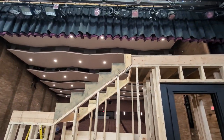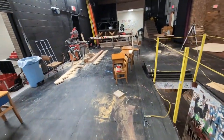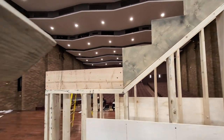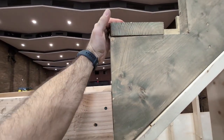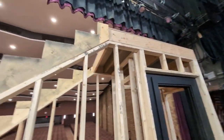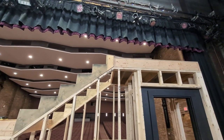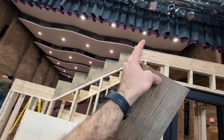Well, it's damn close, but it's not going to work. You've got to remember that you're going to add 1.5 inches for a step on this first one to start with. Meaning you're here, and then it's an awfully tall stair, even after a landing surface of material, which won't be 1.5 inches. And then at the top, by the time you add this thickness to that step on top, you're obviously wildly too high. So it makes a good example of how different stairs are, even at this angle.